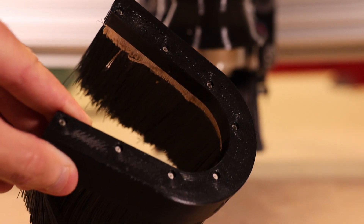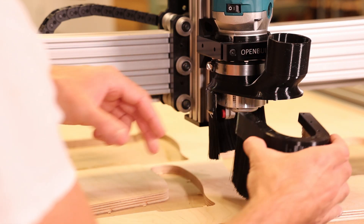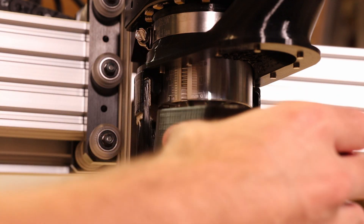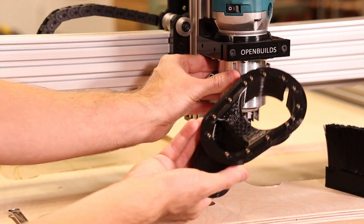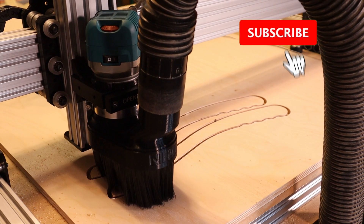It has the typical magnet design which allows for easy access for tool changes. The first prototype uses 3 by 10 millimeter magnets, which are a little bit too small. The modified design, which I'll link below, includes 4 by 6 magnets and has magnets protruding by 2 millimeters so that any side force will not be able to knock the shroud off.